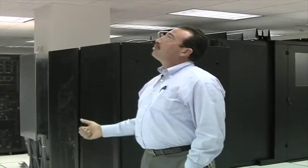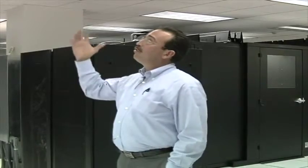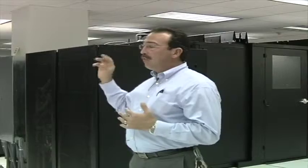Okay, just to give you an understanding of how Novec or clean agents work and how they descend into the room, you're not going to have a discharge and the whole room is going to turn cloud white. Okay, it's more of a curtain effect. You're going to have a discharge and the pressure is going to be blowing out. The Novec 1230 in the cylinder is liquid, but once it reaches the nozzles and is being blown out into the area, okay, it vaporizes.